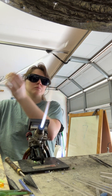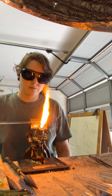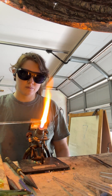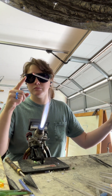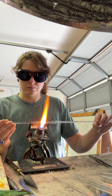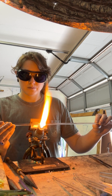I pulled away from the rod and it left a little stringer. I'm going to melt that in, and next time I'll bicycle it away to make sure we don't get any stringy hairs that need melting back in — that just takes extra time. Remember that end is very hot, so be aware and don't touch it. That will lead to a second degree burn.